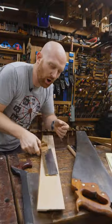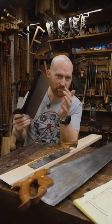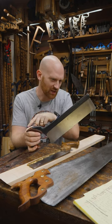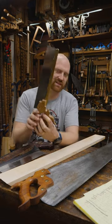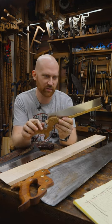When it comes to small ripcuts, the exit wound really isn't that bad. So that's why most of the time, when I'm talking about something the size of a carcass saw or larger, I would generally prefer to use a crosscut to ripcut. It's gonna be a little slower, but I'll get a cleaner cut for both of them. But if I'm talking about something smaller like a dovetail saw, I would prefer to crosscut with the ripcut than to do it the other way around.